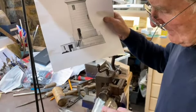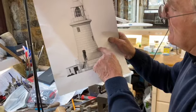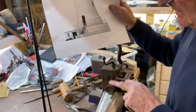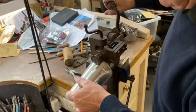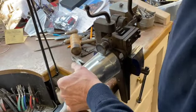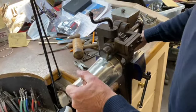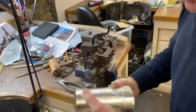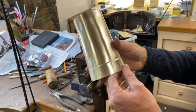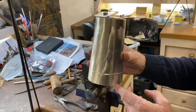So I'll use what they call a spinning jenny to do that. Now the body's all made here. What I've got to do is get this little section here — I don't want to solder a piece on, I want to make this all out of one piece. It's a better job. So I'm going to use an old-fashioned tool called a jenny. If I turn the handle around, you can see it starts to throw the edge up. As you can see on there it's just started, so I'll bring this out even more — it's got to come out two or three mil yet. And then I can work on the whole thing to get that step that's on the original drawings.